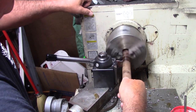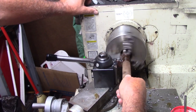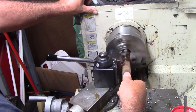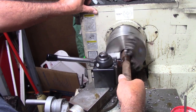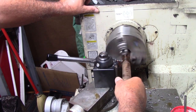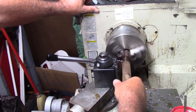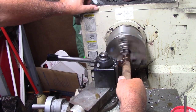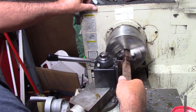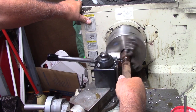I've got several of these I'm going to make — probably one for each drill. I'm going to have a set of them from what Anthony sent me, and then I'll probably have to make a holder somewhere to put them where I can get to them, with the sizes engraved on them and everything. This is going to be a long-term project. You'll probably see me make one or two on camera; the others I'll make off camera and then I'll show the full set in a video later. Probably what I'll do is drill a rough hole and come in with these spade drills to make bigger holes, because of the horsepower required.